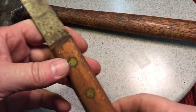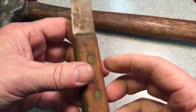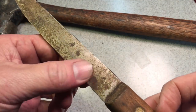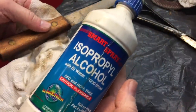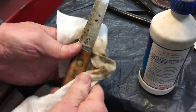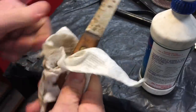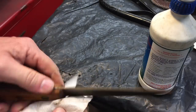When you have a wooden handle, you don't want to put this in water because it could cause swelling. So whenever you're cleaning something like this, a good thing is mineral spirits or alcohol — something that'll dry off quickly. Then you can take it to the sander. We'll hit this on the wire brush and see if we can get some of this off. I feel a little burr here, so it was probably abused. We have some 90% alcohol — we're going to spray the whole knife down, give it a good dousing, wipe it off. If you do cut yourself, you have less of a chance of losing that finger when you do it like this. We'll try and wipe off some of the hand grease around here — I feel much better working on it knowing it's been alcohol cleaned.